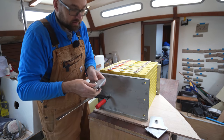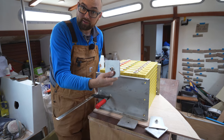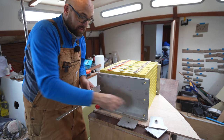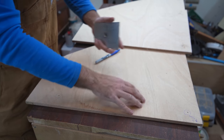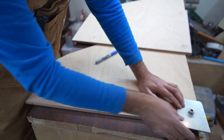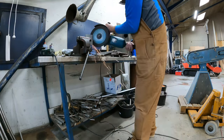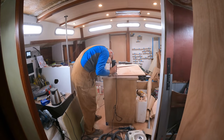I ended up making the bottom out of two separate pieces of plywood. Between the two I'm going to sandwich these pieces from the scrap pile in the workshop — these are what I'm going to be threading the bolts into, because there's not enough room to access the bottom from underneath. Here are the two pieces: the bottom of the bottom is where I'm going to inlay these little pieces of stainless. After a trip to the workshop and a bit of persuading with Mr. Angle Grinder plus some sanding, I marked the positions on the plywood and removed the needed material.